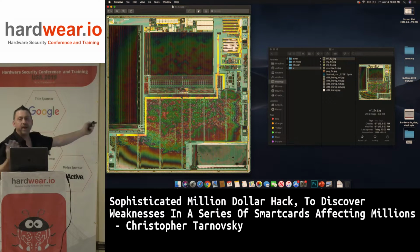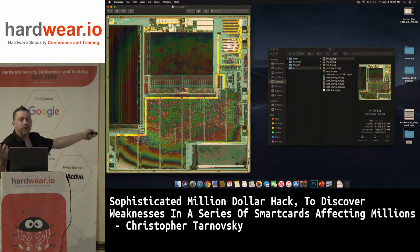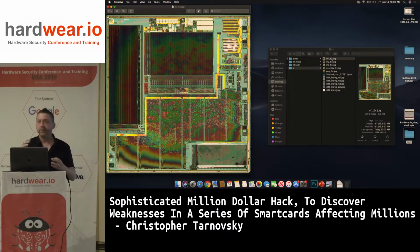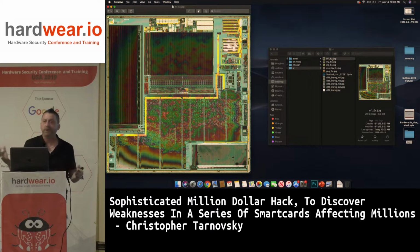And honestly, like on every chip out there in the world, where does it boot up from? It boots up from here. So where are you going to start tracing from? You're going to follow from here and go into this core somewhere. Now, this is a fully synthesized core. In the past, they used to run microcode, so they'd have these micro ROM tables inside the chip. It was so easy. You just walked up to the edge of it and you knew the flip-flops were right there, latching the instruction into that microcode to execute.